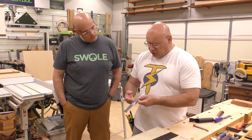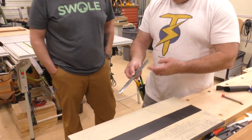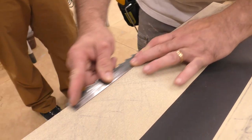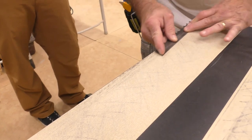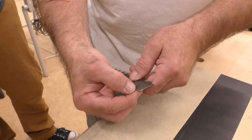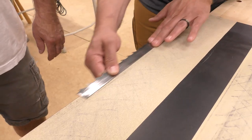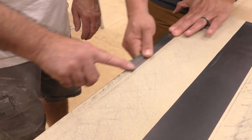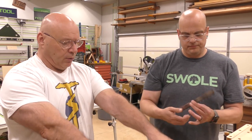Now that we've knocked down those teeth ever so slightly, it's not sharp, so when we bend it we won't cut ourselves. What we want to do is make sure that this gets a perfect 90. I get this on 120 grit paper on a hard surface and just run it along like this. What I feel for as I do this is whether there are any nicks in the blade. I just take my nail and run it — I don't feel anything. Sometimes I'll switch my pressure to make sure I'm getting the whole blade. I really like this length — I can bow it and take my glue lines down.